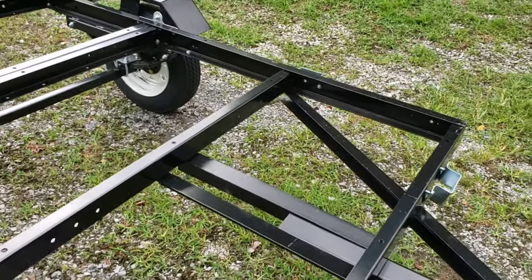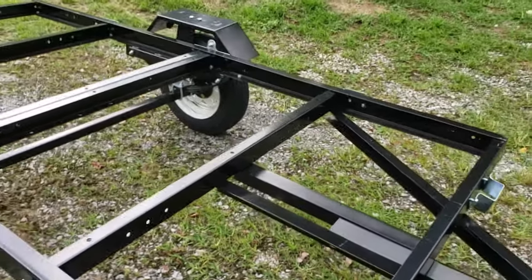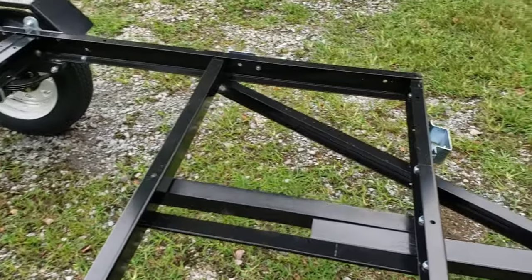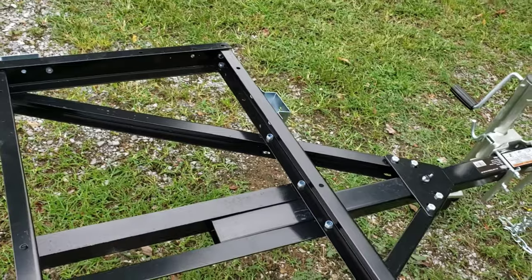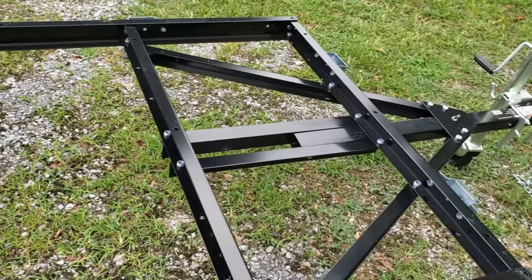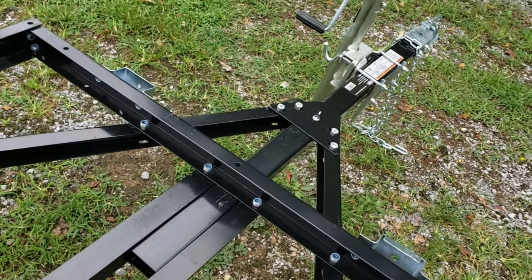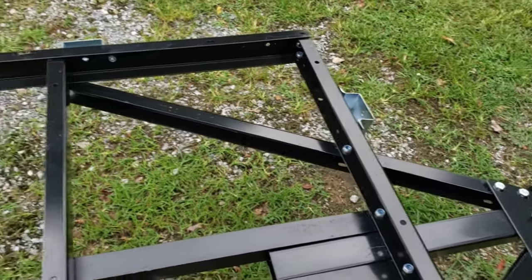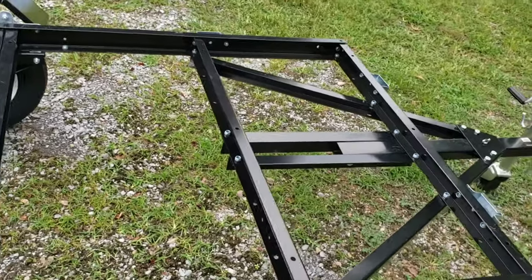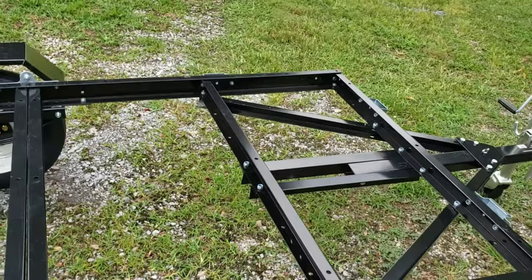Because when I went and tried to YouTube this to get some information, there's not a lot of stuff out there. Most of the stuff's already pre-finished in the videos. All right, so one of the biggest things that I ran into was these prefab rails. They are cut and drilled, and they have to be specifically in the correct place. If not, when you go to tie into them later on, like such as this triangle pattern in this tongue, you're going to run into a lot of issues. I found myself going 2 and 3 steps in a row, only to get to step 4 and have to backtrack 3 or 4 steps to correct several different items, all because of the orientation of a bar.